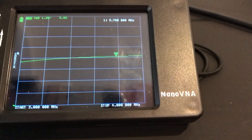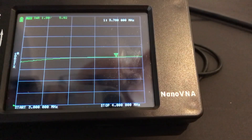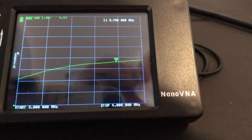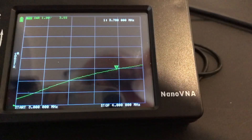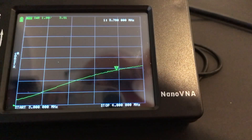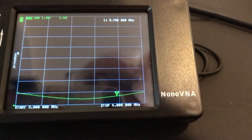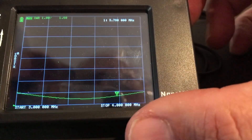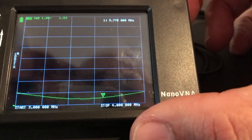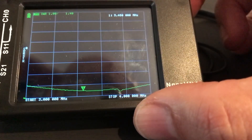The first thing I've done is left the capacitor fully engaged at the highest capacitance value, and moved the tap until we get the lowest SWR. At the moment it's higher than it was, so let's adjust our capacitor and see what happens. As I crank out the capacitor, our SWR starts to drop quite markedly. At 3.7, I'm going to move the tap — if we move one across, we get an even flatter response. That's now at 3.7 giving us 1.6 to 1 SWR, which is a very usable SWR. As we get down to the low 3.5s, it's 1.44 to 1. I'm extremely pleased with that.